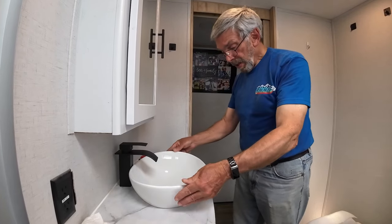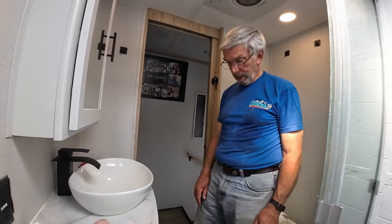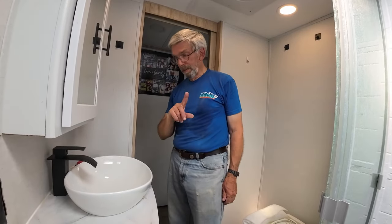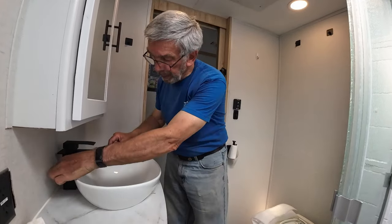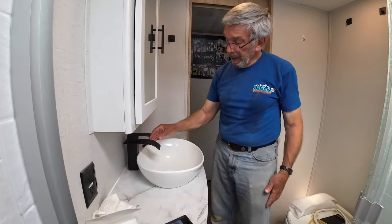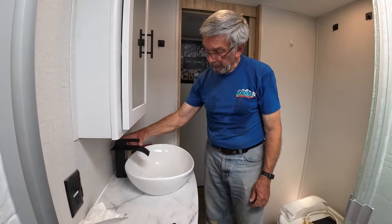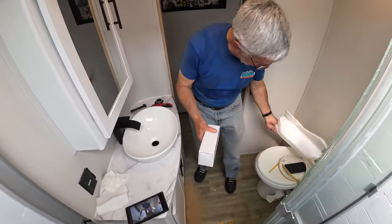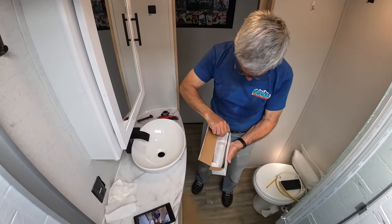It's in there pretty tight. Now you can't put the drain in now because you won't be able to get the vessel in — the faucet's in the way. If you put the faucet in second, yes, you can do that, but it makes it harder to install — it's extremely difficult because there's so little space in the back. This being a relatively large square makes it quite difficult. So depending on what type of faucet you put here, that will determine whether you need to put it in first or second.